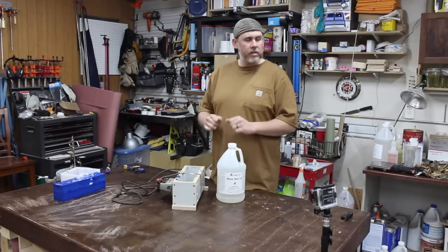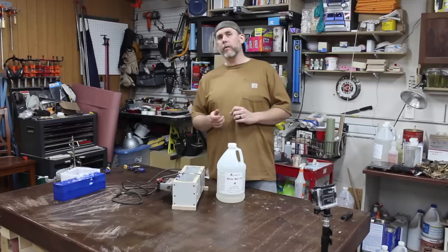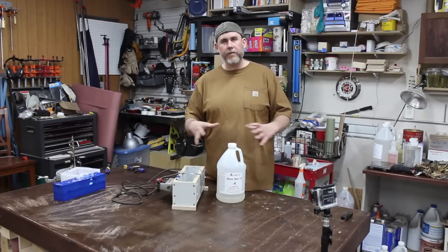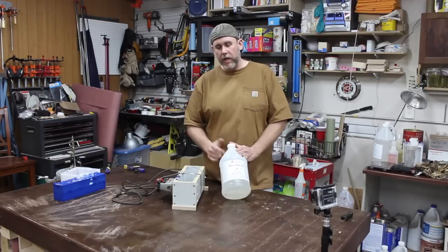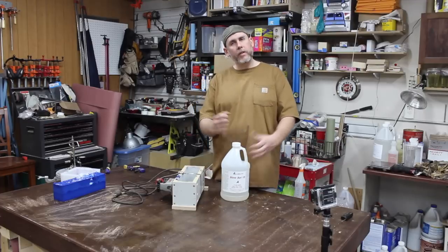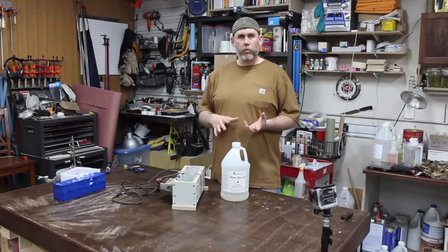I did a small batch quick and then turned it. It turns pretty much the same as the Alumilite white. But it's got an overnight cure, and it's a good 15 minutes of open time. So I actually think I probably could have done this pour by myself. It's open that long. So it's good stuff if you need to do a really big pour or something like that where you need a lot more working time.